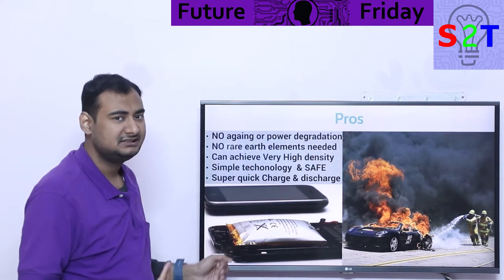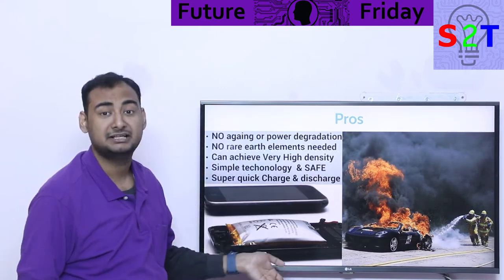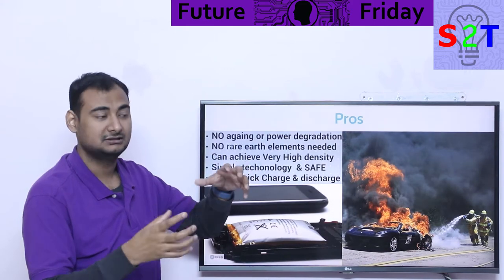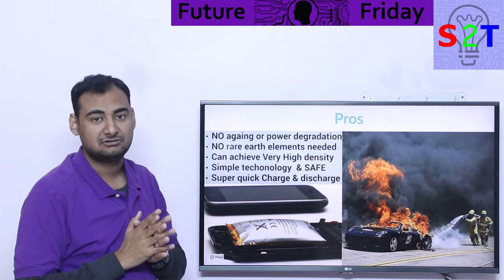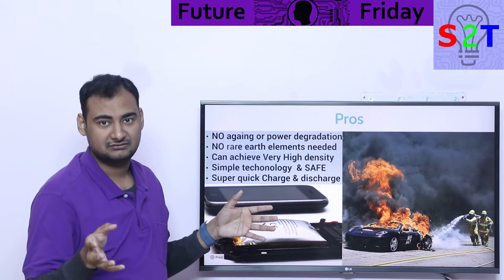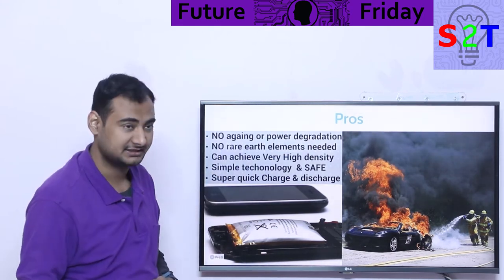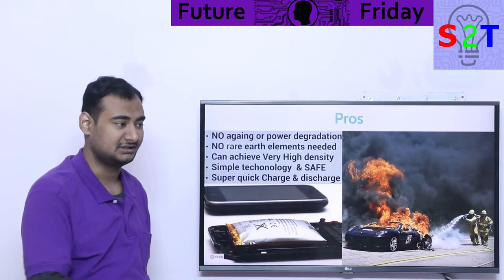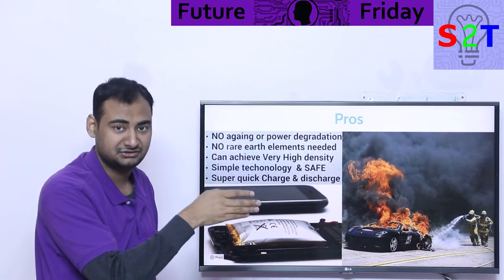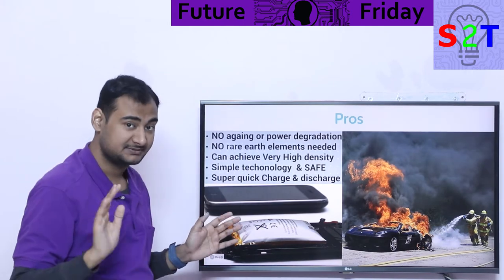Another aspect is that inherently there is nothing complicated. It's a simple technology and it's safe. It will not swell up and catch on fire. Yes, there is a risk since it's a mechanical thing: it could break. Every flywheel energy technology requires a casing, and the casing has to be strong enough so that if the internals go boom, nothing comes out of the casing. That's the primary requirement. It will damage the casing and be destroyed, but it will not cause harm to other things. That's a primary requirement of an energy storage system. You're going to stack multiple cells, so you want to make sure damage is limited to that one unit, and doesn't destroy 15 or 16 things. That has been taken care of.